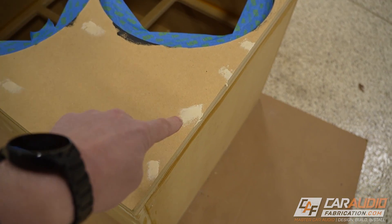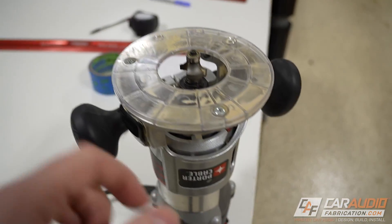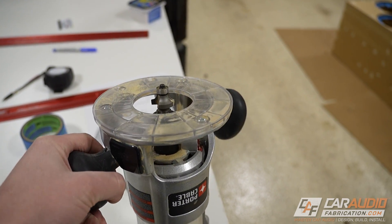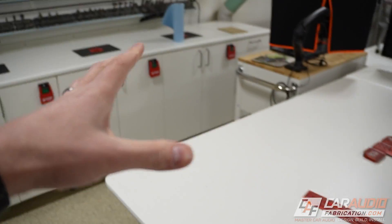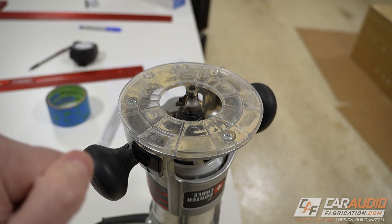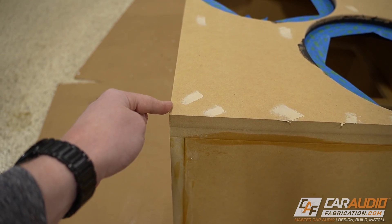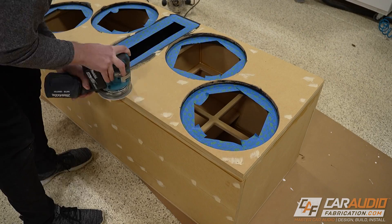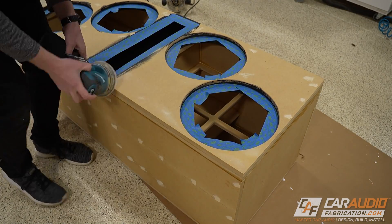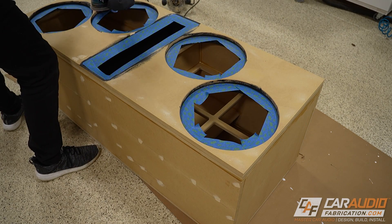After allowing some ample time for the filler to completely dry, we're now going to turn our attention to using the router. I currently have a quarter-inch round-over bit loaded here into the router, and normally I would do this step on my router table, but because this enclosure is so large, we're going to use the handheld version. I'm going to be using that round-over bit to soften up these hard corners on all sides of the subwoofer enclosure, giving us a much more finished look. Before I can start making those router passes though, I do want to do the sanding of that filler so that the router doesn't get hung up on those little patches there — and this process goes really quick, the filler sands extremely easily.